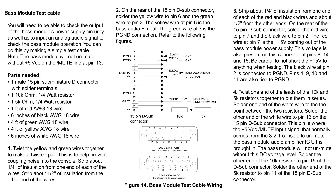Here is how the original documentation suggests proceeding — on page 66 — for the sole purpose of testing the woofer module independently. Considering that at pin 15 a source of +15 volts is available, they suggest building a simple resistor network to get 5 volts from there, and feeding the test signal between pin 6 and ground.